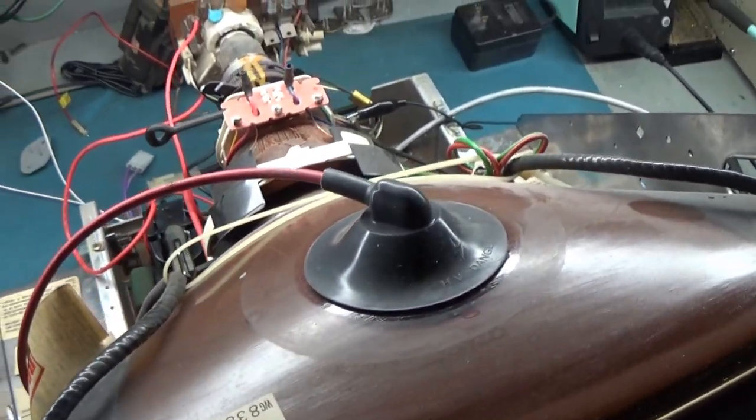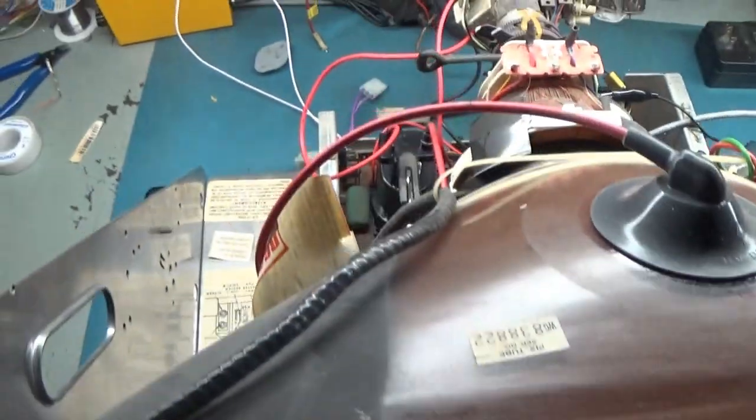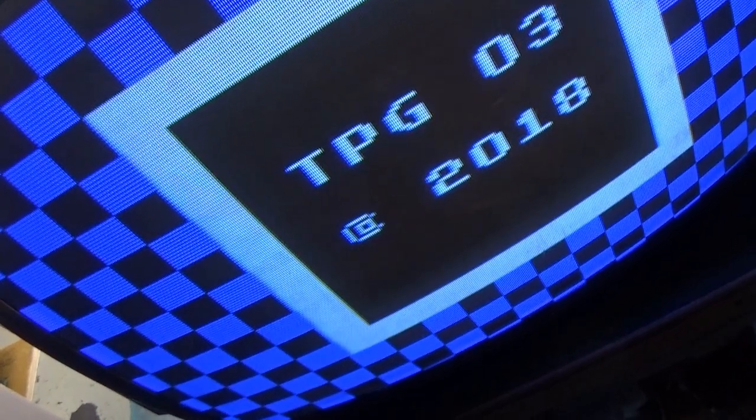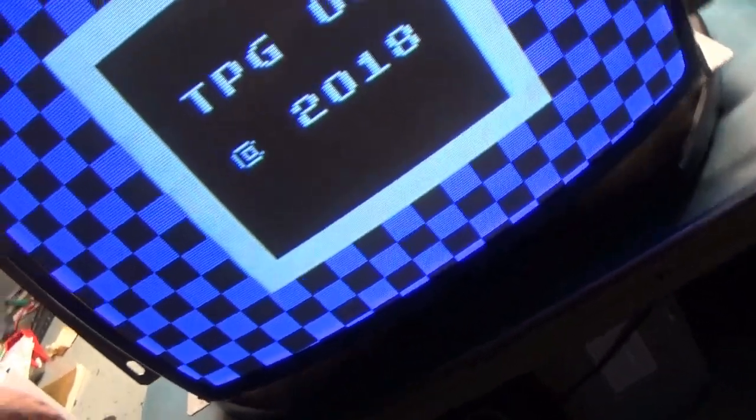Springs back to life. Okay. We will start by turning brightness. We'll leave brightness where it's at. Let's just turn up the flyback here. What can we get here? All right, we do have an image. That's good. Vertical hold. There we go. And let's turn up brightness a bit more. Obviously focus, gorgeous. Alright, vertical size is going to be here,